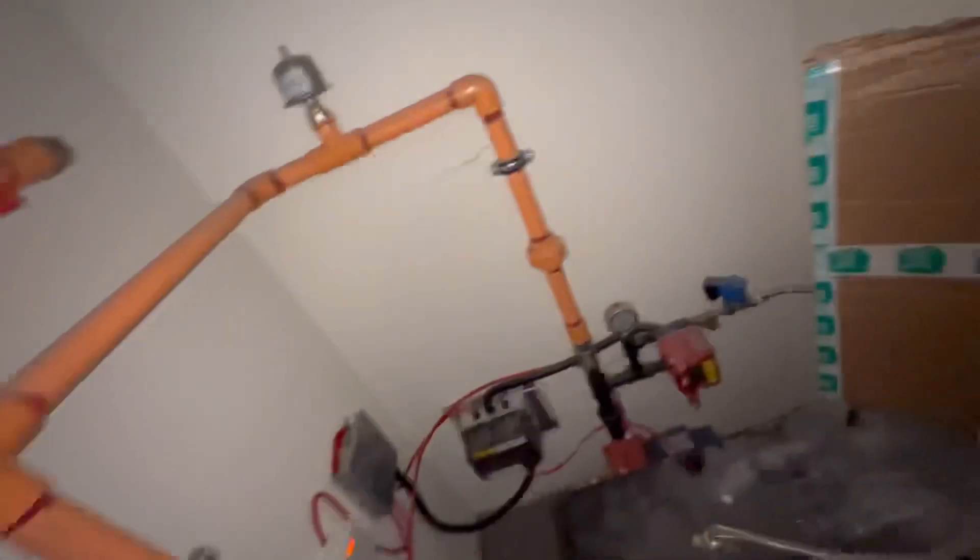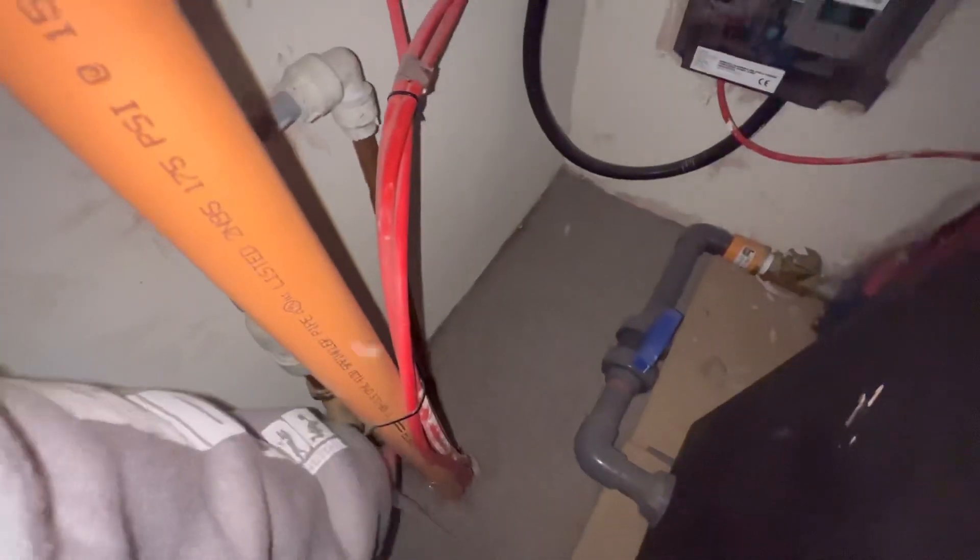So I don't flood four flats, I've asked the customer to stand in the shower area and give me a shout if anything starts spraying water everywhere. This would be really daunting for an apprentice on this job. I just turn the water on very, very slowly — don't want to just hammer it on and blow the plastic out of something or blow another fitting. So that was all good. First try, can't complain.